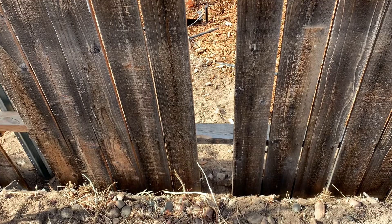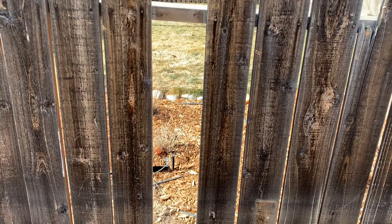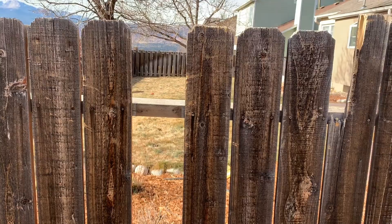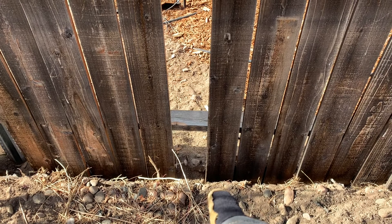The next thing we need to do is measure the old picket so we have the right cut length for our new picket, so that it will actually match these other ones. Now something to take note of — this is kind of a weird fence line here because there's a little bit of a trench that goes down in here. Normally the fence would sit just a touch above the ground, and that prevents it from sitting up against the dirt and potentially rotting. In this case, we're just going to mirror the other ones to keep things consistent.